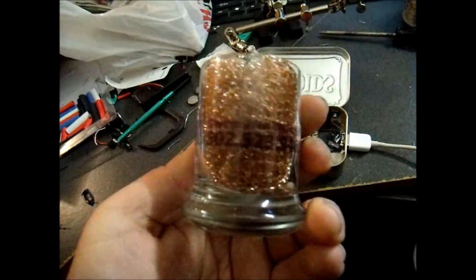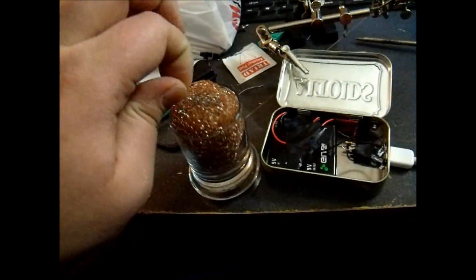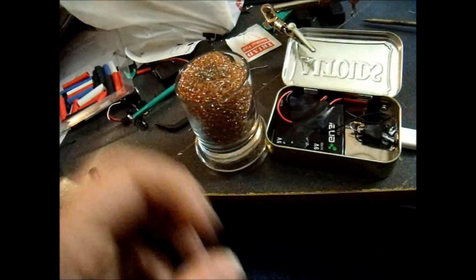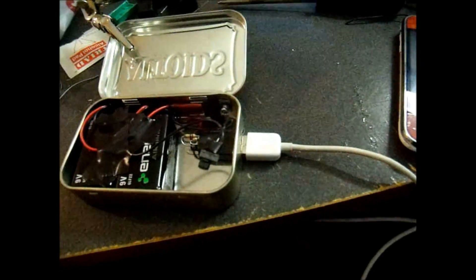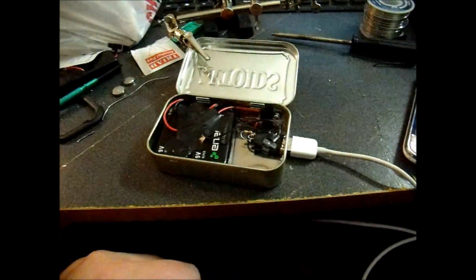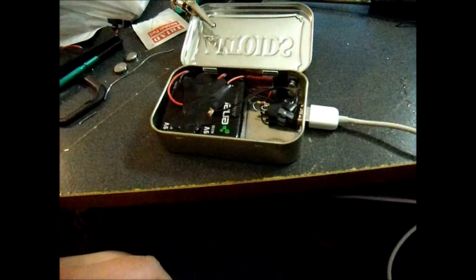When I was soldering, I had this little glass dish with a copper scrub pad — basically like a bristle pad — and I use that to keep my soldering iron tip clean. I always use lead solder, 60-40. I don't really believe in lead-free — it takes more heat to melt, which can be dangerous to components, though on this project it doesn't really matter too much.